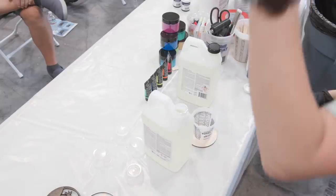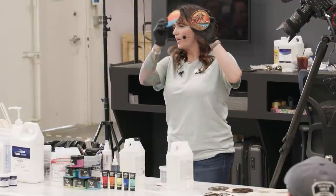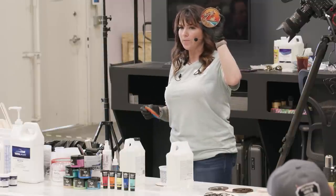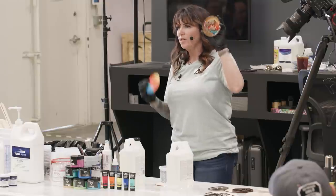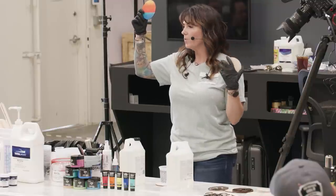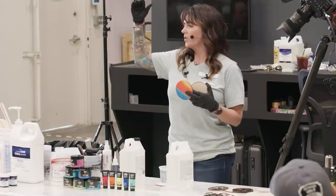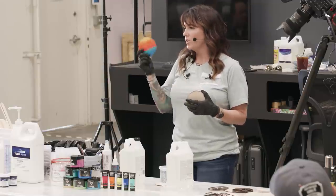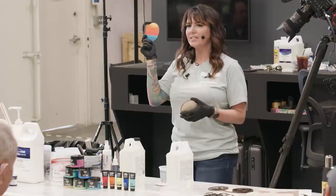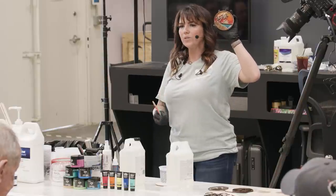His question was about painting the backs of pieces. This seems really complex — you look at it and think, 'how did you get that gradient, you must have used four different colors of epoxy.' Paint your substrate. On the lake table we're making later, I'll show how to paint the inside of the river and use only clear epoxy. It's so much easier to paint your substrate because you can control it — if I don't like it, I can easily sand it off.